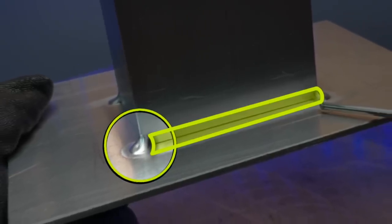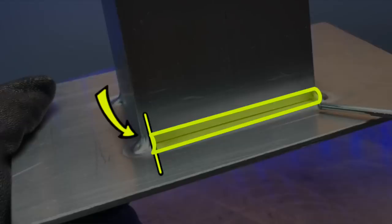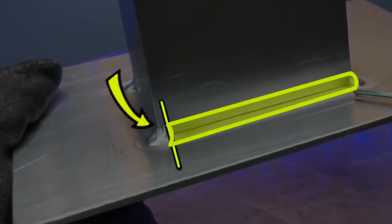When we think about things in the way I'm recommending, let's think about doing the first pass completely perfectly. We're going to keep the first straight weld a straight weld, running it with extreme detail, keeping things completely organized — nice and straight and in line with the joint we are traveling along. Then we're going to stop just shy of the corner. If you have a tack on the corner, you can stop just shy on the edge of the tack. At this point, we have not attempted to do anything with the corner yet — we've created a perfect situation that we're now ready to deal with. I'm going to stop, reset, and get comfortable again, and now just focus on welding the corner.